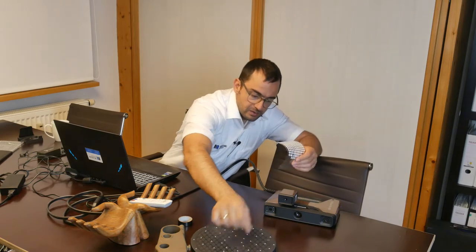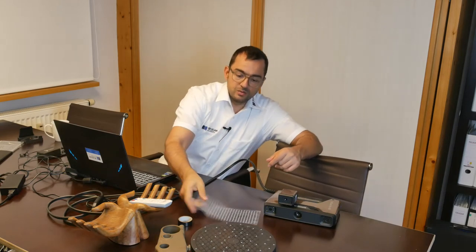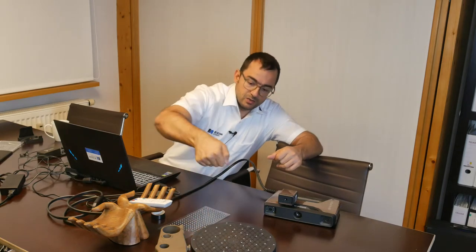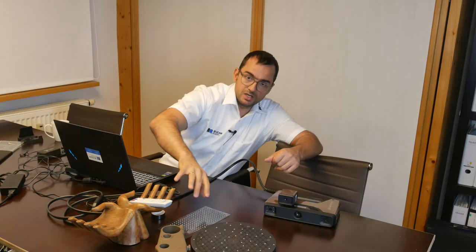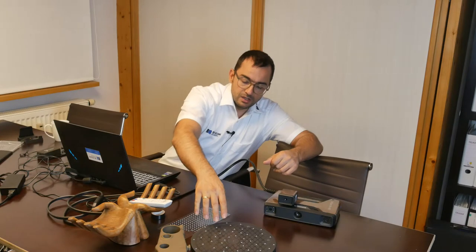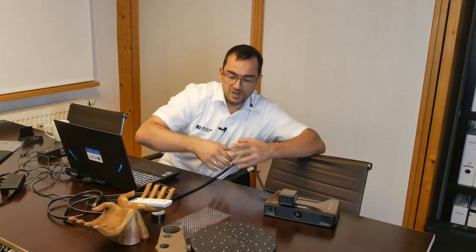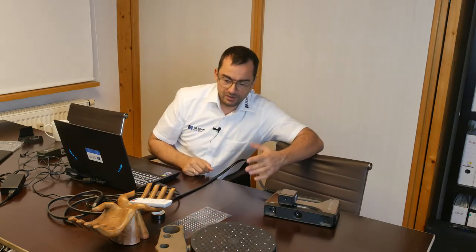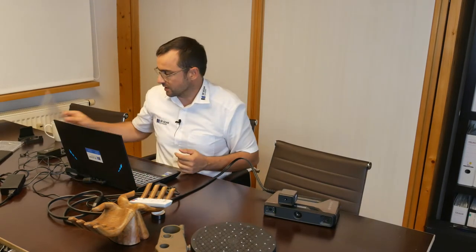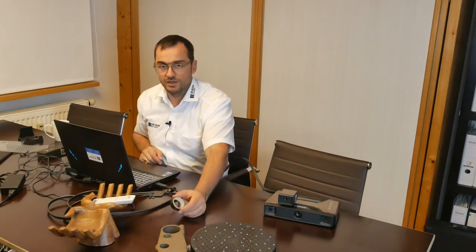Also, be very careful about leaving marker sheets beside your scan, for example when using a turntable. It can happen that you're scanning part of the marker field, which makes your scanner confused because it's a totally symmetric matrix. Sometimes you're in a hurry and you leave a sheet of markers beside your scanning area — it will give you a lot of headache and you may not immediately understand why.